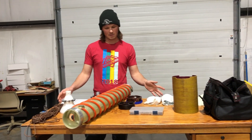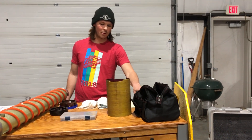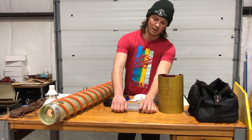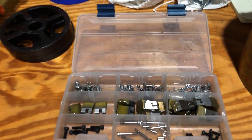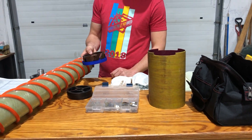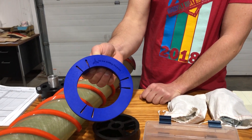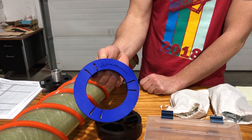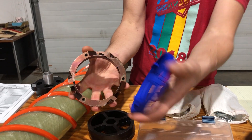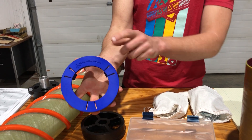All these items will be shipped in the one meter bag. There's a tool bag with various assorted tools that will also have a small parts kit. The small parts kit is going to have all your cutters and core dogs. We've been shipping the cutter head pretty much set up, so it'll have core dogs and cutters pre-installed. This is an example of the cutter head with the guard on it — it just twists on and off, and these tabs here line up with the core dog windows and snap on, protecting operators from the sharp cutters when not in use.